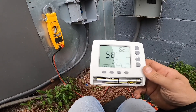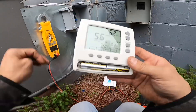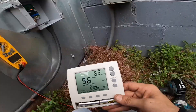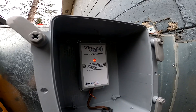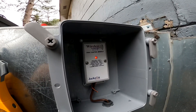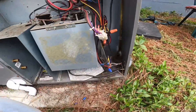The fan just came on. I'm waiting to see if the heat pump comes on and starts running in heat. Basically all I have to do now is mount this on the wall and snap that to it — that's it. That flashing red means heat. It's calling for heat strips and for the heat pump to come on. So I'm fixing to go check things. I have a call on my electric heat — I have a call on blue, but I think it's timing out on yellow.